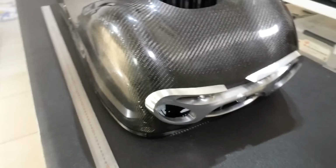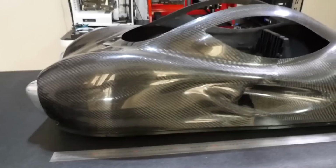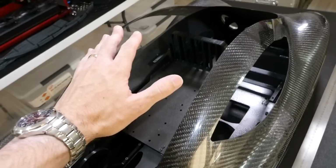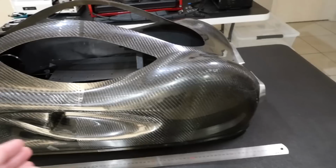But we have ventilation on the front, so the grills actually do give quite a lot of ventilation, and behind them are two 120mm fans. So that is the same for both grills. So there is airflow moving out of the front and out of the rear, and there's also going to be quite a large amount of ventilation up high here, working with convection, because then there is going to be eight 140mm fans on the radiators drawing air up through the bottom of the case. So most of the hot air will end up, you know, up here somewhere, which is where there'll be a lot of ventilation. And then, you know, we also have that extra airflow pulling out of the front and rear.